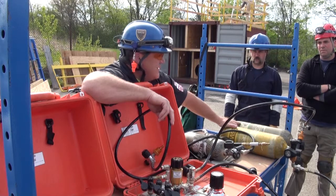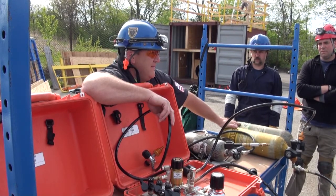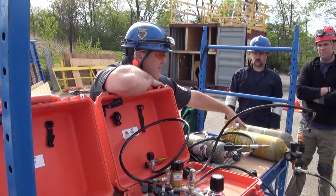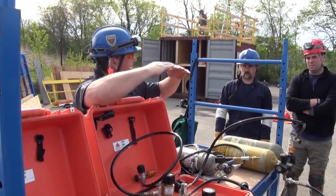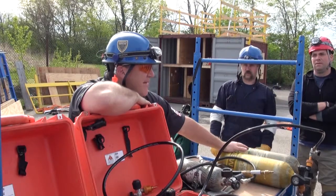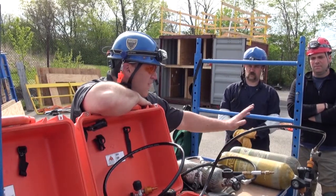One rule about this: I want you to only use one input, because it will always take the highest pressure. So if both of these bottles are on and they're both at 4,500, it will alternately drain one and then the other — dropping them equally — so that means both of these bottles would die at the same time.